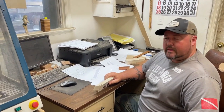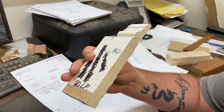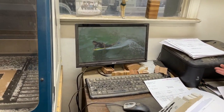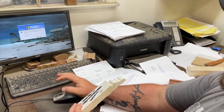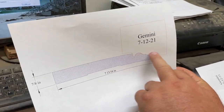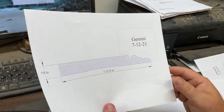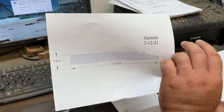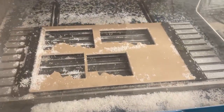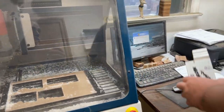This is the molding head cutting room where it all starts. When someone brings in a profile they couldn't find anywhere else, Jason scans it into a scanner, pastes the profile into the computer, and uses his CAD program to trace over the design. Once he has the CAD file, he makes a template for the steel cutters. That template is then sent to the CNC router, which cuts a negative of the profile out of acrylic plastic in the exact size needed for the machine.